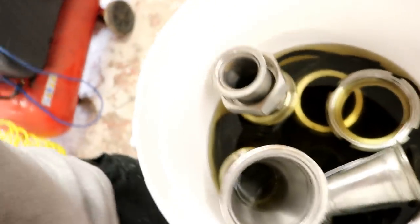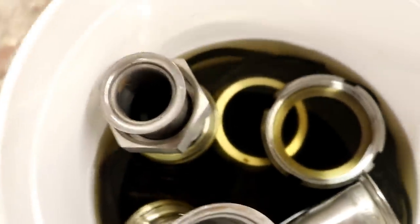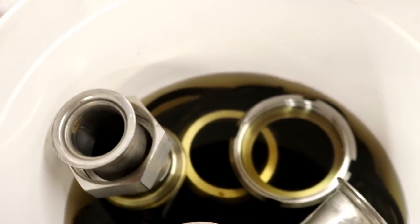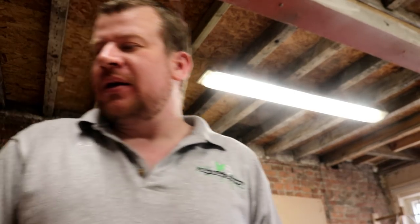I'm having a look at the gaskets that we put in yesterday. The liquid has taken on some colour now, really starting to bring out some of those chemical compounds from the contamination. But the rubber is supple, really nice. There are a few little bits that could do with more soaking, so I'm going to leave them overnight again - that'll be two days. You can leave them up to a week in this solution, so I'm not concerned about degrading the rubber.